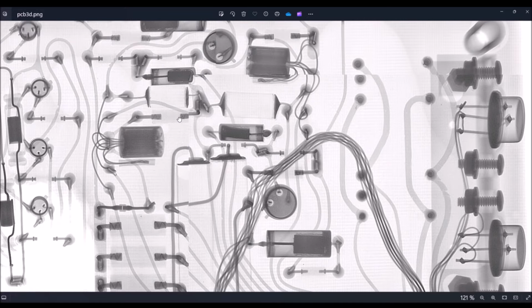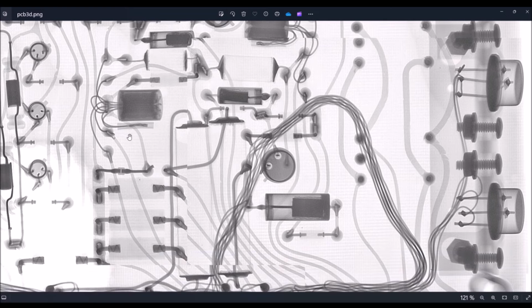Okay, we can see that we have here a resistor also connected to the power supply. So this resistor is connected to one point here, which should be connected to the middle point actually of the secondary side of this transformer. Okay, and the middle point is connected also here to this diode, which is connected to the ground. This diode permits to have a DC bias of 0.6-0.7 V on both secondaries.